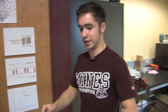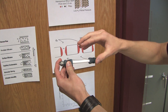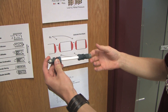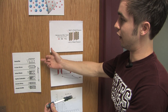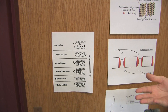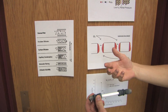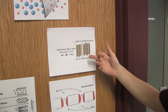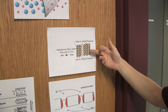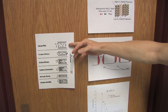We'll be using a ceramic tube, something similar to this here, and we'll be applying a membrane on this tube that hopefully separates hydrogen from other gases. Currently on this tube, viscous flow occurs — if a gas passes into the tube, all the gases can escape through different cracks and pores on the tube wall. But we're going to apply a molybdenum carbide membrane so that surface diffusion will occur rather than viscous flow.